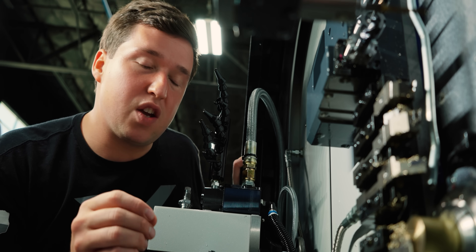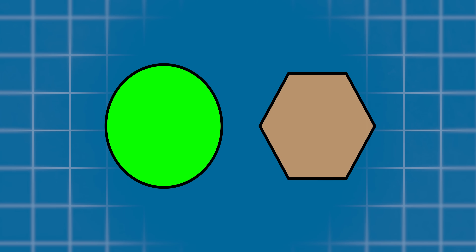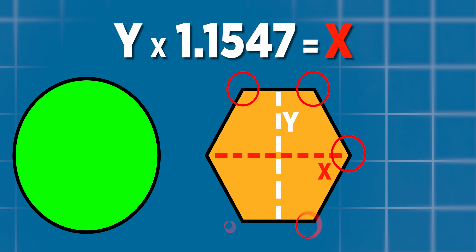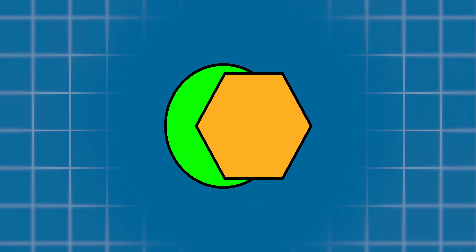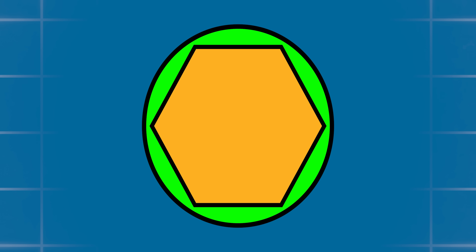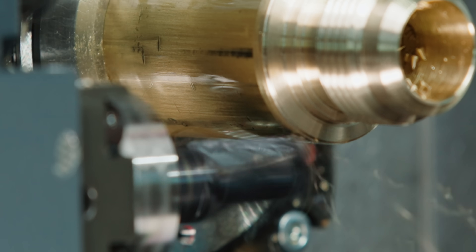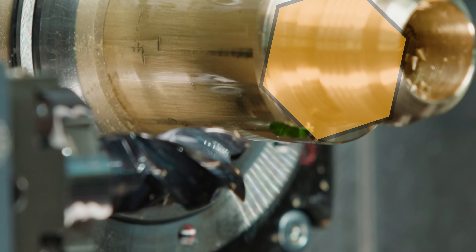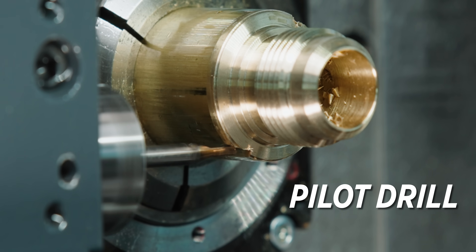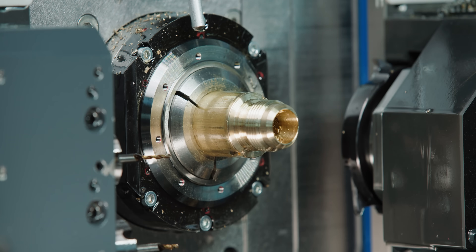One of the tricks to this is that you have to have bigger material than normal. Normally when you look at a print and you look at your hexagon size, you multiply that by 1.1547 and that gives you the OD of the points of your hex, and you'll typically order the closest material size to that. But when you're doing this trick, you have to get material that's just a little bit bigger so you can fit these tools in before you mill the hexagon. The same tool that mills the hexagon is actually gonna come in and put a little notch in the space above where the hexagon is gonna be, so a tiny pilot drill can come in and put a little spot in there. After that, the longer drill comes in and puts the actual wire hole in.